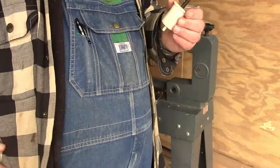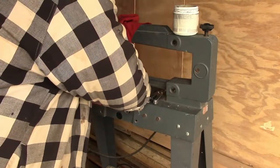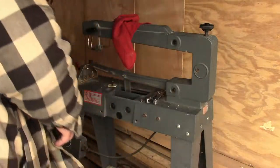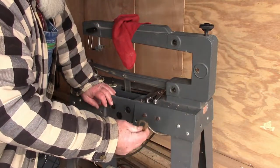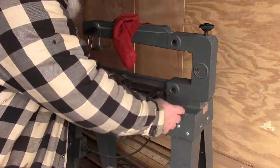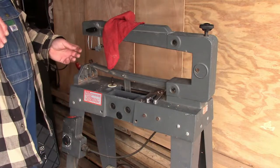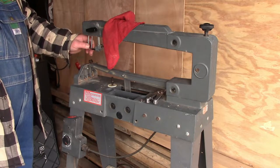Okay, that's pumping a stroke of air every time. At this point I want to put this back and then reinstall it. Under here, hanging, is a plastic tube. This tube fits on the bottom of that little air pump and it pumps air through the tube, goes up here, comes over to here, then to a metal fitting that's closed off a little bit to give a little pressure — and that's the blow tube for your woodwork, to keep the sawdust off of it.